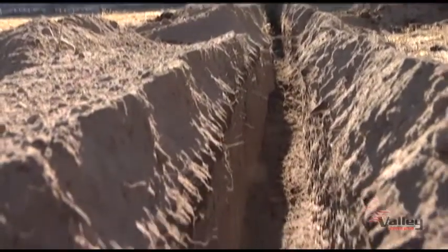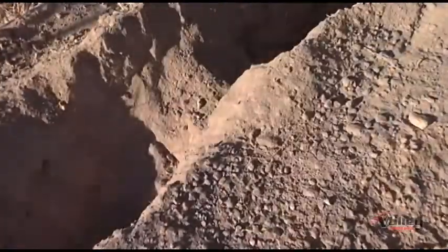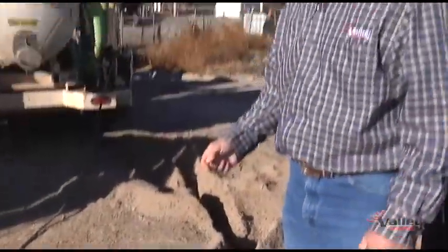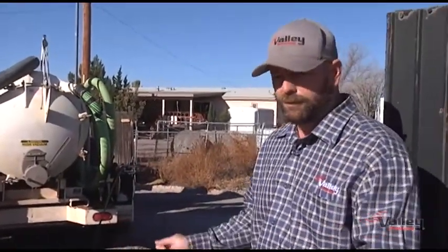Occasionally when we're going through the yards, we run into obstructions such as water lines and drip system lines for trees. Like this, we got a footer from between the gate here, and we're going to accommodate that by using the jet vac and blowing a water jet hole underneath it, and then put our conduit underneath those. And that same we would do with water lines or any other utilities that may be in the yard.